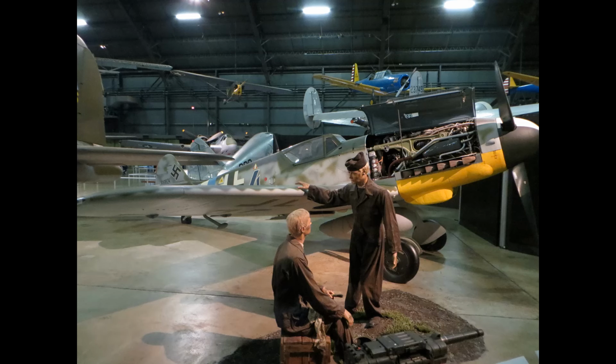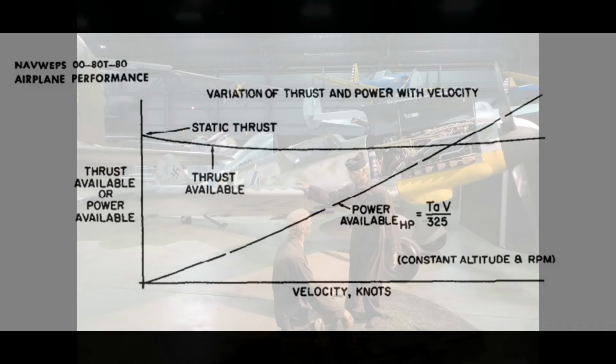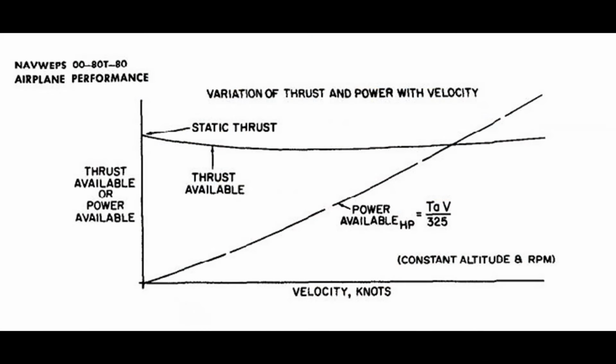Furthermore, the turbine engine can make more and more thrust by spinning faster and faster. This is relatively easy because all the parts are spinning in the same direction and you don't have to worry about propeller tip speed. In a piston engine, you have a lot of parts moving in every possible direction and even reversing directions as the piston engine's crankshaft rotates. This, combined with the limitations of the propeller's tip speeds, make running a piston engine in an aircraft at super high RPM very problematic. Jet engines have the additional advantage of having relatively constant thrust as speed increases.